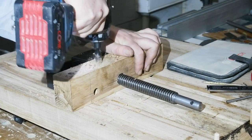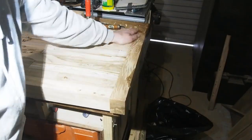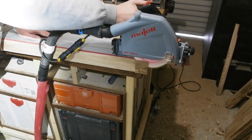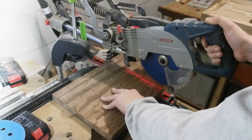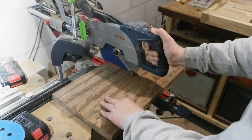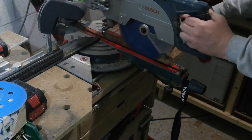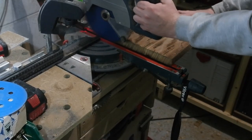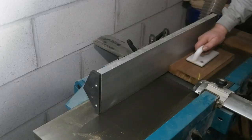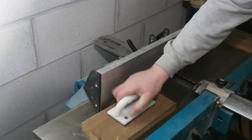A pre-drill and countersink for each coach screw before carrying on with the vice. The dowels now dry, I can flush up the breadboard ends — I just used a carriage plane top and bottom, and the trusty plunge saw for the ends. For the moving vice jaw I'll be using these iroko board ends I've had sat around for some time. These boards were purchased rough sawn from the merchant so need a bit of a clean up. I give myself a straight edge at the planer, then size a couple of pieces at the mitre saw, planed and thicknessed so I can glue two pieces together to give the jaw some heft.